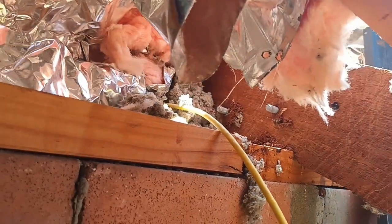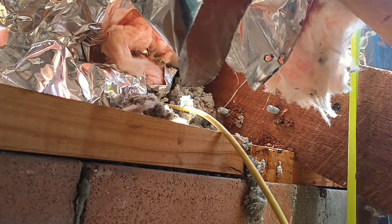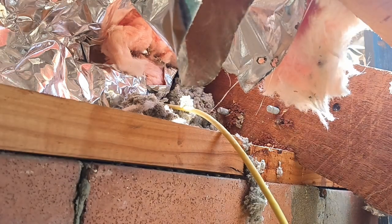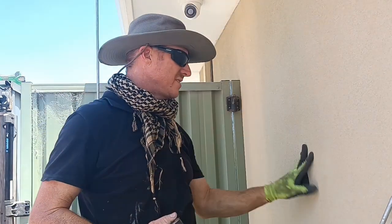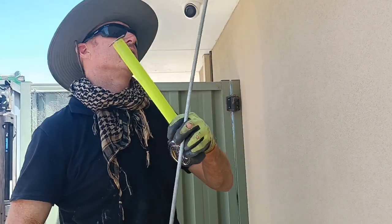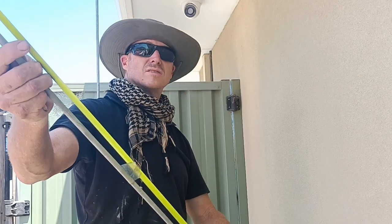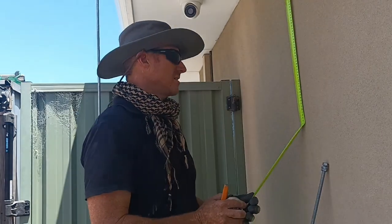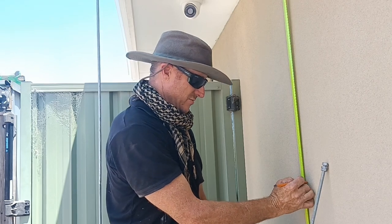Just to give you an idea of where you get your measurements from - that's the back of your wall down to your eave, we're talking 290, 300, we'll just round it to 300. So these have to be 1,200 down from the top according to the engineer. We know we've got 300 of brick there, that means it has to be at least 900 down. This rod is 1,400 long, so it gives us a little bit of play at the top. If we make it a minimum of 900, that'll make it 1,300 and give us 100 at the top. But I want to make it 950 because I don't really want to have to cut off the top.